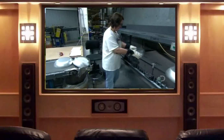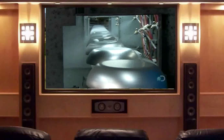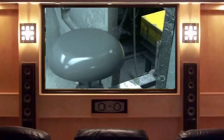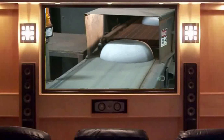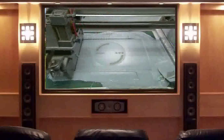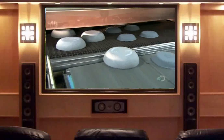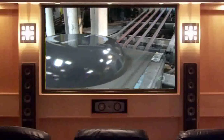A worker inspects the pans and places them upside down on spray fixtures — a tight fit to shield the inside from the enamel spray. The pans spin on the fixtures and twirl by the spray nozzles for an even application of enamel to the exterior, followed by a glossy clear coat. The frying pans then transfer to a dryer conveyor where hot air pulls out water from the enamel coating, changing the color from gray to chalky white. An automated squeegee silk-screens the company name and other information onto the pan bottoms. They then enter a long curing oven heated to 560 degrees Celsius — the cure toughens the enamel, deepens the color to gray again, and adds gloss.